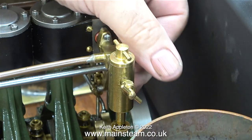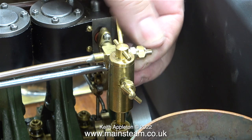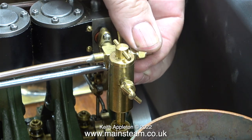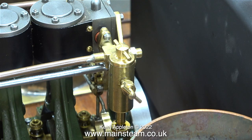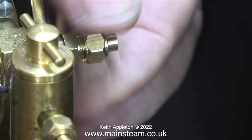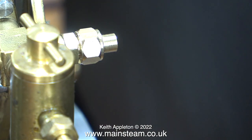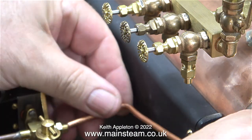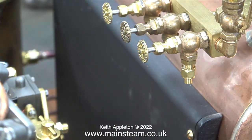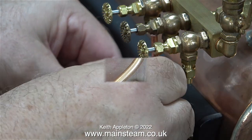This thread adapter from PM Research is a bit on the small side — I think it's designed for a thinner union nut. When I try the standard union nut in place it does not tighten up properly; the steam cone would leak. For that reason I removed the union nut and turned a little bit off it so now it's a bit shallower. A union nut is no good unless it puts positive pressure on the flange part of the union cone — this one is now okay. It's pipe bending time; this section is running at high speed and shows how many times I did a test fit before I was happy it was in the right place.